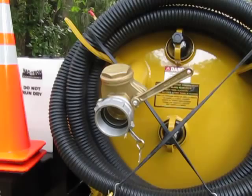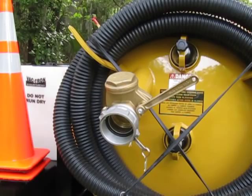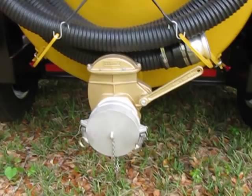When you're going to pressurize the tank to purge the hose, you close this valve and let it build up to full pressure, which is only about 4 psi, but there's a lot of volume in that tank, so you get a good purge of air. And then all at once, open the valve quickly and whatever's in the hose will purge out. You also can pressurize the tank and offload liquid materials only out of this 6-inch discharge valve at the bottom of the tank.